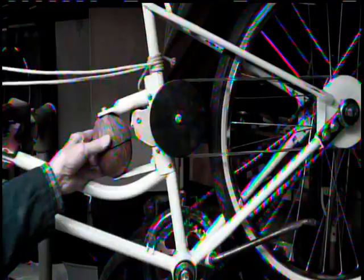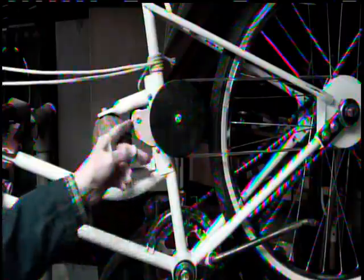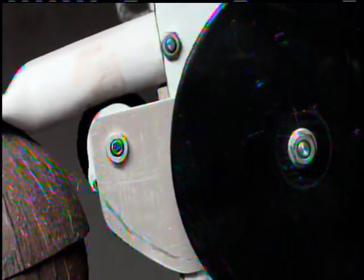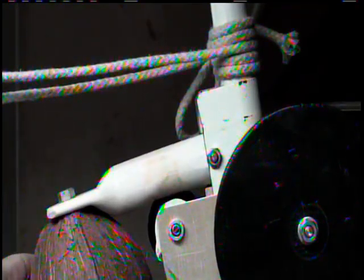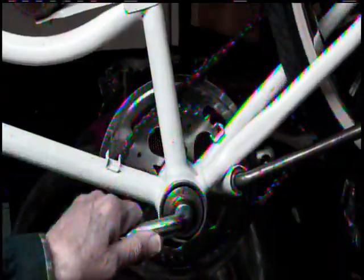Here's my clopping device — a coconut cut in half and hollowed out, mounted on an arm with a support on the bottom. It's operated by a cam with rollers on it rather than a solid arm sticking out. There's a lot of friction involved, so I had to put a spring inside to keep pressure on the arm, because when it's going fast gravity isn't enough. The sprocket is a 36-tooth, 6-inch diameter sprocket. For the chain guard I use one from a 10-speed bike — it keeps pants out of there and works great.